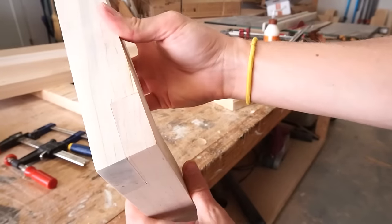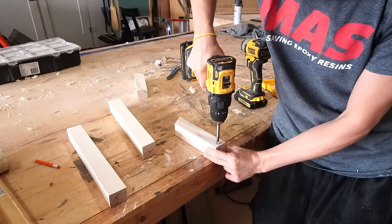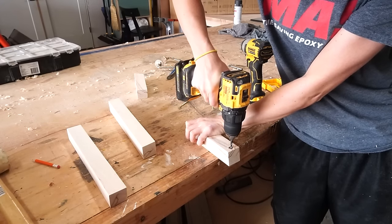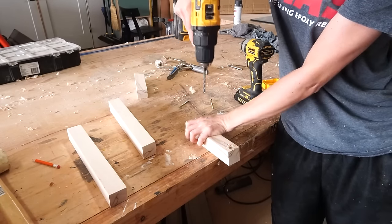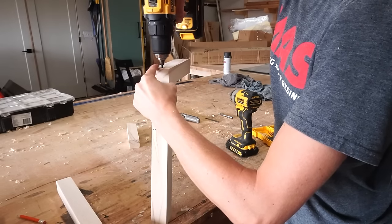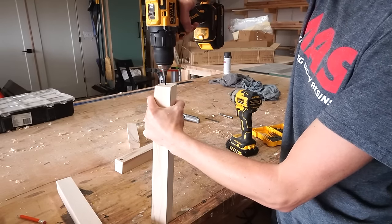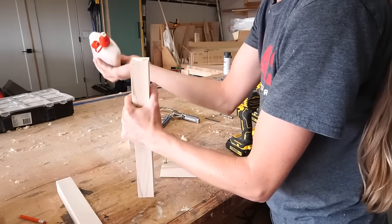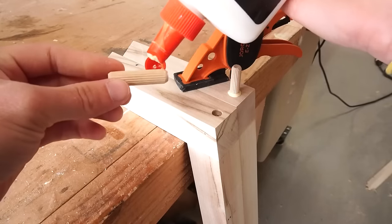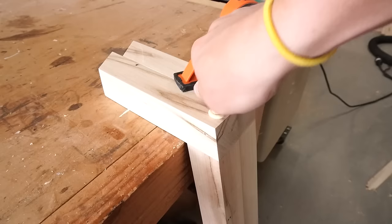If you didn't want to mess with half laps, I also made this same design for the smaller table using just wood glue and screws. I cut the legs and braces the same as before except shorter. The main difference is that since these aren't overlapping each other, the leg pieces need to be shorter since they will rest underneath the braces. To attach these I used a 3/8-inch Forstner bit in the top of the brace piece to drill out a small hole to plug later with a dowel to hide the screw. I pre-drilled through the piece, placed it on the leg, and pre-drilled again. I used plenty of wood glue and a 3-inch screw to attach these pieces, then used a 3/8-inch dowel to plug the holes. Once dry I trimmed them off with a flush-cut blade on my oscillating saw. Both methods turned out fine.